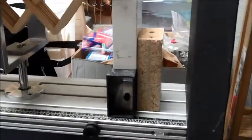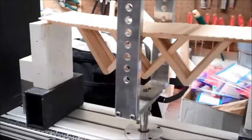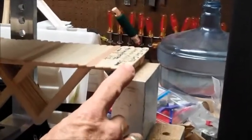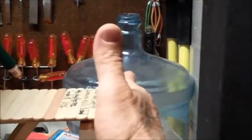This is the setup for the stick-together testing apparatus. When you see this bridge, the maximum bridge length is 17 inches. This bridge is actually only 16 inches, so he's not taking advantage of the full bearing width of the bridge. Any loading that happens on this bridge goes right to the center and has to transfer to the bearing support, so you're putting more load on the edge instead of taking full advantage of the width. This bridge is at a disadvantage compared to a bridge that would have been an inch longer.